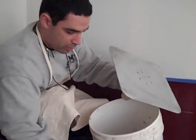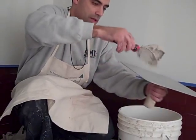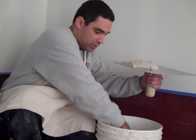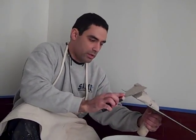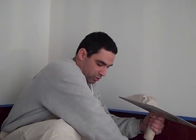In position, okay, and we're actually going to be cleaning a kitchen wall. Now, this is a commercial grade clay, which I'm going to have to seal if it's going to go in a kitchen or bath. You don't want water hitting this directly. So my customer wants this, and we recommended doing some sealer on it, and then that's what we're going to do. It'll be fine. It's a juice bar, so we're not talking about food grease coming off and splashing on it. It's just water, and it's sealed.